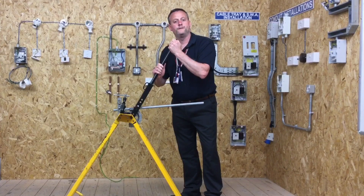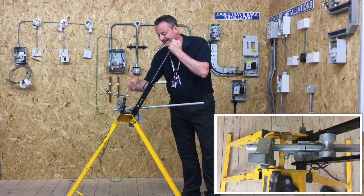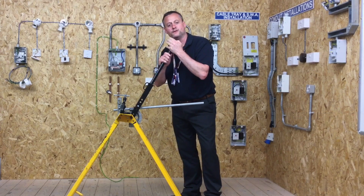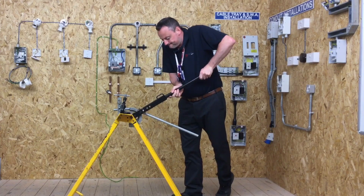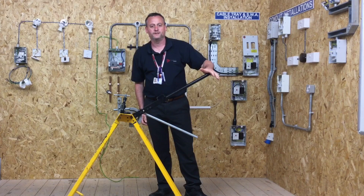I'm going to put my first 45 degree bend in. I've set it up — I've got my 150mm measurement marked against the wheel of my conduit bending machine and I'm going to pull my first one in slightly less than 45 degrees for this technique. We'll stick with that at less than 45 and we'll see how the next stage goes.